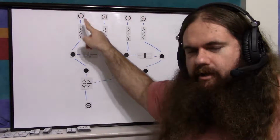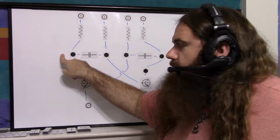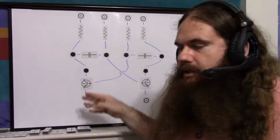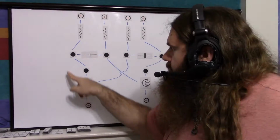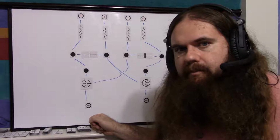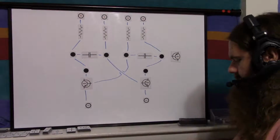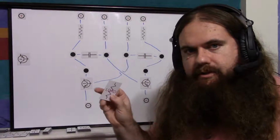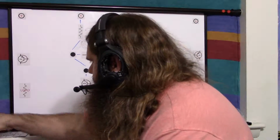So when the capacitor charges and we want it to stop, this will be fully charged to about 5 volts. So a high signal is when we want the load off. When this transistor is on, we want the load on, and this is connected through basically to ground. So we want a 0 for the load being on. So naturally, that implies PNP because it's reverse. So our two PNP transistors, in fact, I need them out a bit further. So they're connected through power, and I haven't printed two of the vertical loads yet, so we'll just make do with this. This is the basic layout.